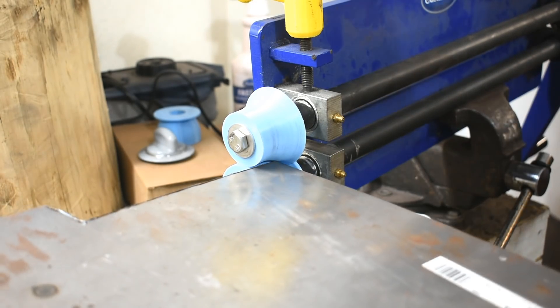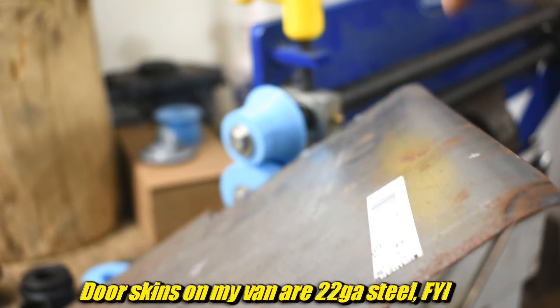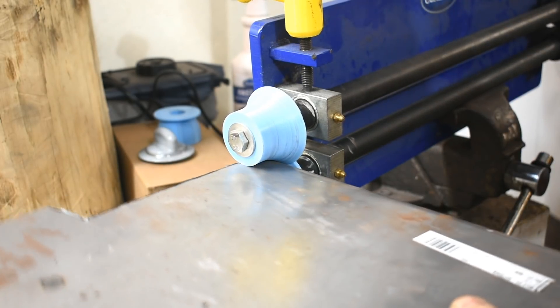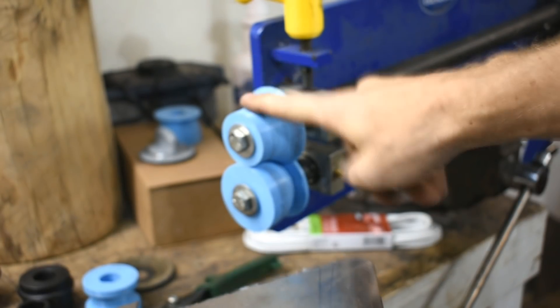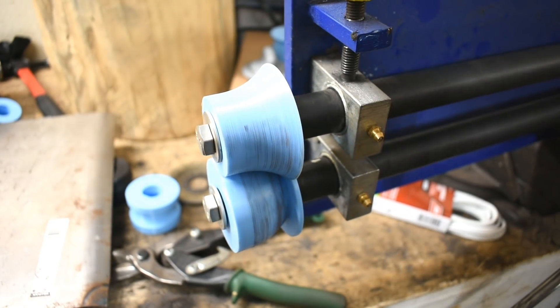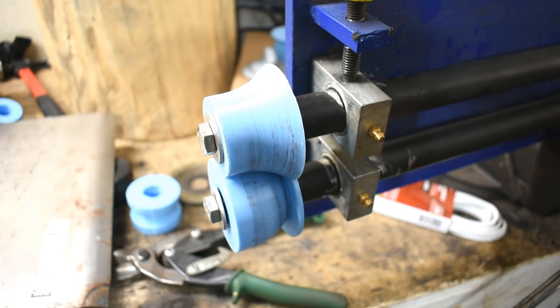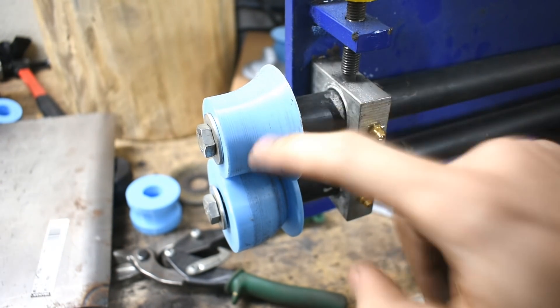22-gauge steel — this is thinner steel than I really plan to use very often. It worked. This is a pretty gentle radius, so it's not trying to move too much metal all at once. That went much better than I had planned on it. I'm going to make up a bunch more of these, probably still in nylon because they'll last better. They don't even look that damaged — kind of dirty and oiled, but preliminary test says it's okay. Pretty cool. These weren't even printed very thick — three-layer shell thickness and 10% infill.